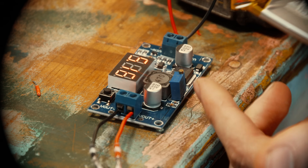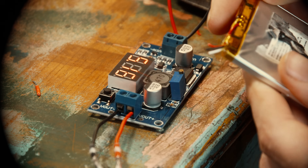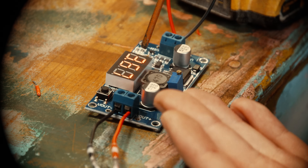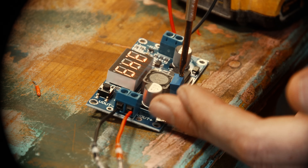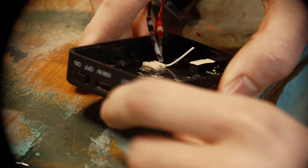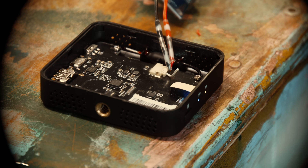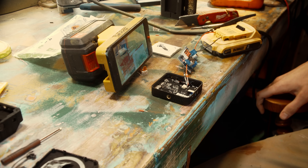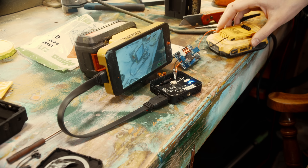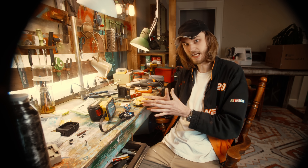It's powered on. I'm sure there's a fairly wide range that it'll actually run on. I'm going to assume that if the battery is 3.7 volts, it should be safe to run it on 3.7, or even lower, because the battery is going to go down to maybe 3 as it dies. All right, let's plug her in and see if it blows up. It's not fried — but does it work? Take the monitor off the regular HDMI and plug it into the Shimble. There it is. Proof of concept: it is running off a DeWalt battery. I am quite happy with that result.